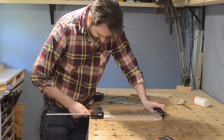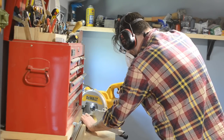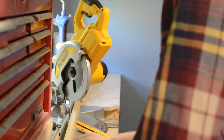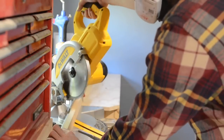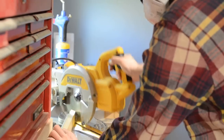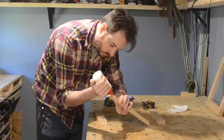While it was all drying, I got on with the table top. The top is going to be a tray style with four mitred corners, so I started cutting out the pieces on the mitre saw. It's going to need a rebate in the bottom for the base, but I decided to do that afterwards so I can get it cut out without resetting up the saw.